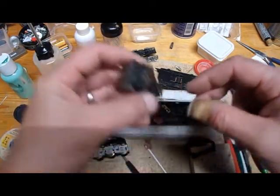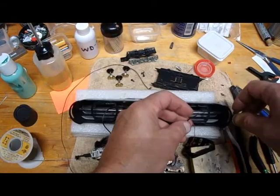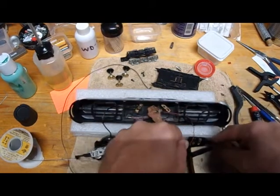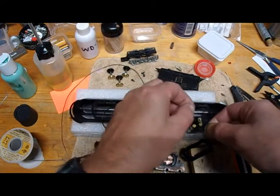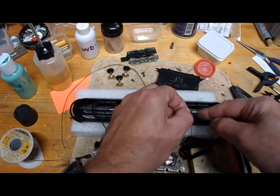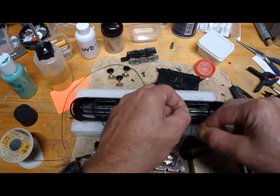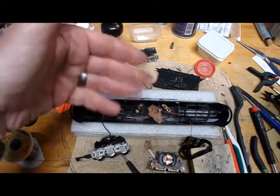The motor does work and it's all here. What happened is this wire keeps breaking off where it's supposed to be attached. It kept breaking off, and you can see some moisture got to this. This wire here is not really clean and it's just going to keep on breaking off.